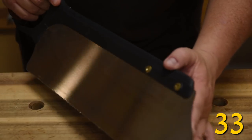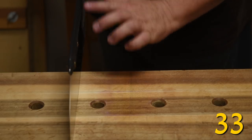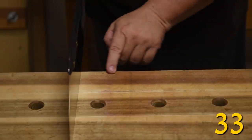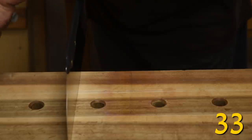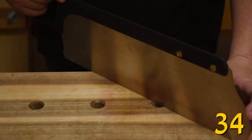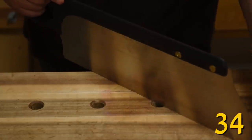You want a nice shiny saw plate because if you can hold it balanced by the weight, you can keep it plumb and light up the reflection in the saw plate — when it lines up with the other side, you know you have a perfect 90 degrees. And if you ever cut a 45, the reflection comes out as 90.